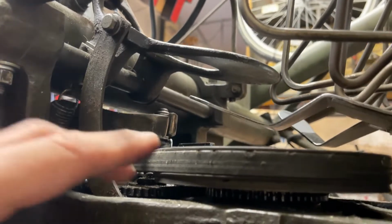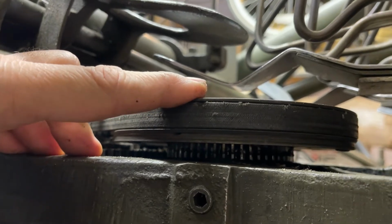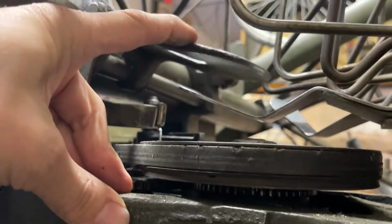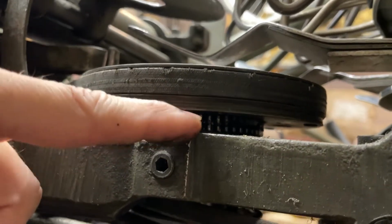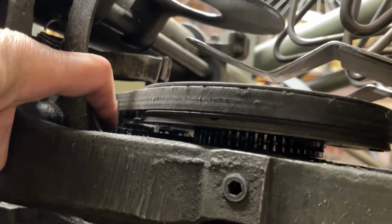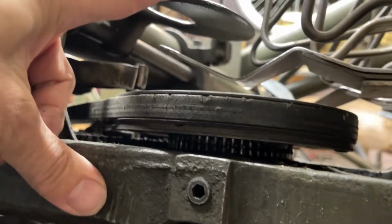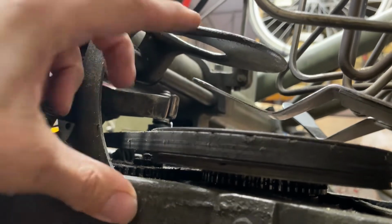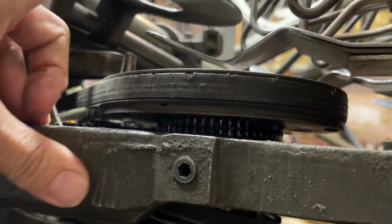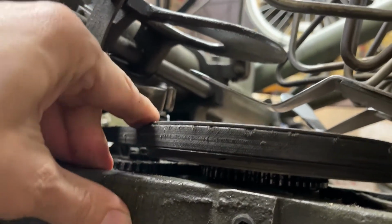Also, this is your turret clutch right here. Whenever the 5 pin goes through, there's no way to advance the turret once, so they had to come up with the turret clutch here, and it's tied to the trip lever. There's a little cam, and there's a gear right here on the back that's geared to this. You see the teeth under here? There's a gear on this time delay gear, and it's got a little lobe on the bottom of it, and when it advances one rotation, it'll actually push the trip lever without a pin having to drop, and that's what advances it one time.